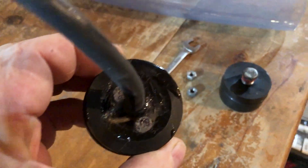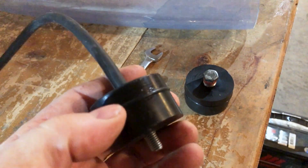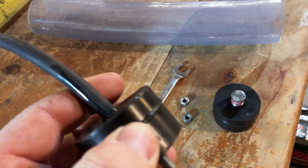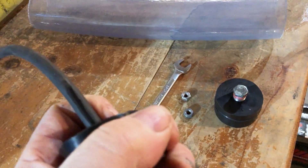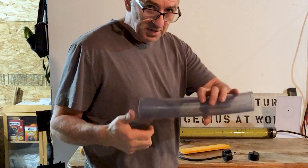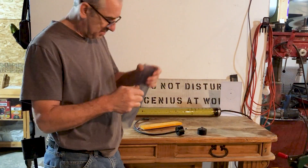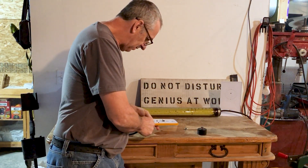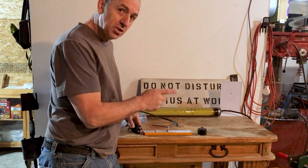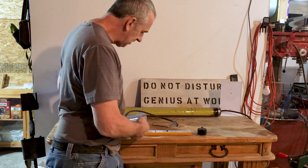This is the piece after it's been epoxy filled — you can actually see the bolts with the wires inside. I've machined an o-ring groove and left the o-ring proud, so the groove is not as deep as it would be in metal because I want it to sink right into the vinyl tubing. Now I connect the wires to the board. This is the vinyl tube the light is going to go in — already cut and tested. I bolt on the positive and negative terminals, and I took it over to the submarine to confirm polarity before sliding it in.